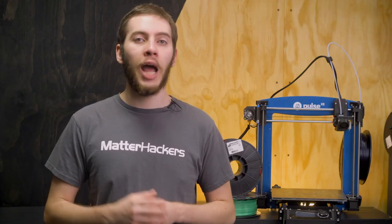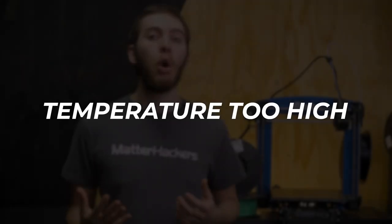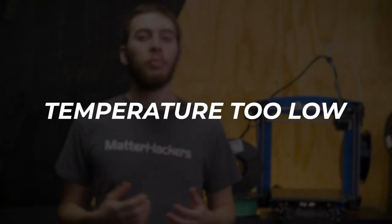When printing with a new flexible filament, I start with the recommended print temperature right in the middle and adjust up or down by 5°C until I find the quality I'm looking for. If your spool is dry but you still hear sizzling or see stringing and cobwebbing, you may be printing too hot — lower the temperature by 5°C at a time. If you still see these issues, you may have an underlying extrusion problem like retraction settings or extrusion steps not quite tuned right. A print temperature set too low will have poor layer adhesion and a matte surface — raise the temperature by 5°C at a time until you get good layer adhesion and a glossy finish.